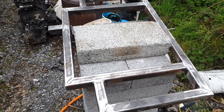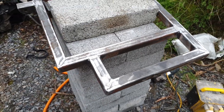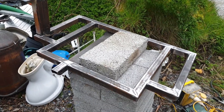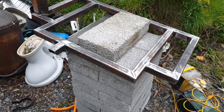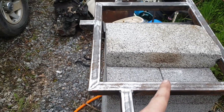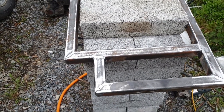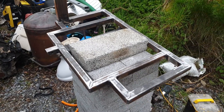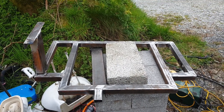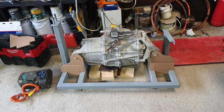I've used all three of the original engine mounting locations to mount the frame. What I'm going to do is get a little dusting of primer on this, let it dry, and get it into the car. We can pop our half shafts in, then we'll be able to locate in this axis where we want our drive unit to be, take the frame back out, take it into the shed, get our drive unit mounted on here, and then theoretically mount the whole thing into the vehicle.